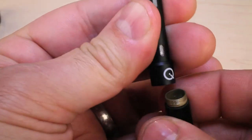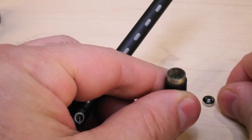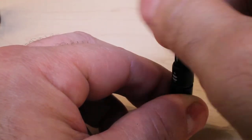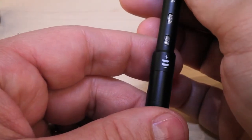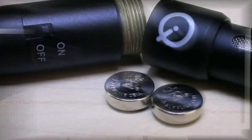To install or replace the batteries in the Mini shotgun, grasp the larger end or base of the microphone just above the on-off switch with one hand, and the barrel with the other hand, and carefully twist off the base while holding the barrel upright. Insert the two AG4 1.5 volt batteries in the base so that the writing on top of the batteries faces up. A picture of the battery orientation is included on the mic for reference. Carefully reposition the barrel and twist it back in place firmly, being careful to avoid cross-threading. Battery life is rated to last for up to 100 hours of continuous use, but typically they will run up to 400 hours. Ten packs of batteries are available through any Q Audio retailer, but AG4 1.5 volt batteries can also be found everywhere.